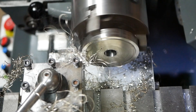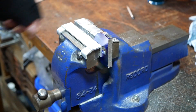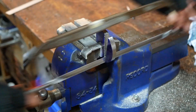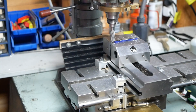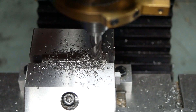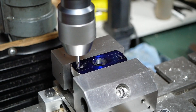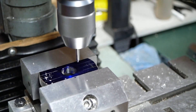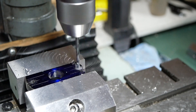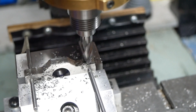The component is finished on the milling machine and for the sake of completion we'll show the rest of the process. We cover the milling machine in a previous video. The Dorr Westbury makes an excellent companion for a Myford Series 7 lathe — the design principle is similar: these machines are not designed to be used in a tool room for a specific job but rather to do as many small to medium jobs as possible. Of course a Hardinge HLV is an amazing lathe, undoubtedly superior to a Myford Series 7 in many respects, but it has drawbacks. The machine weighs nearly a ton and yet has a similar swing and even a smaller distance between centres than a Myford. These tool room lathes often don't have a T-slotted cross slide, which means you can't easily use a vertical slide or bolt your workpiece to the cross slide for line boring operations for example.